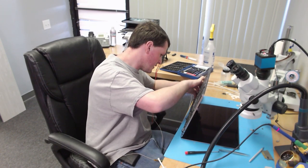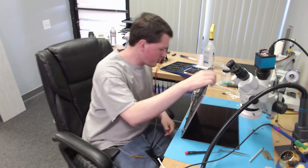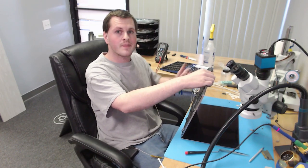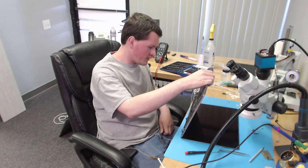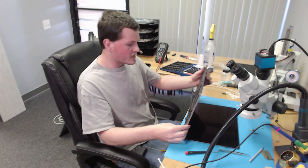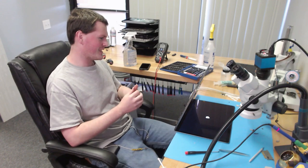Charger is plugged in. We're going to use that same port that we did. I get trackpad click. 20 volts, 70 milliamps, 83, and we have fan spin here. Those fans are spinning, and look at that. That is an Apple logo, so that surprised me. Let's see how much voltage. We're pulling like 3 amps right now, so that's kind of high.